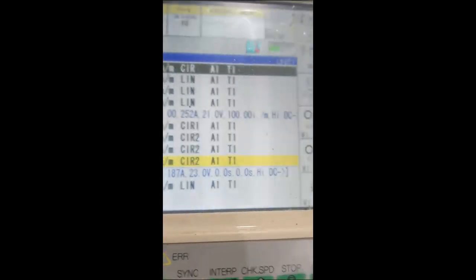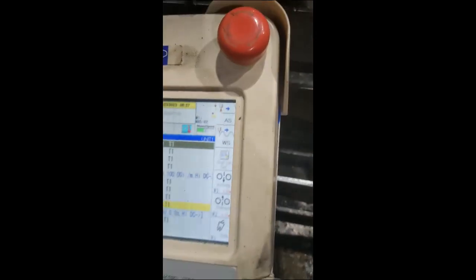We have four circular points: at the twelve o'clock position, the nine o'clock position, the six o'clock position, the three o'clock position, and then back around to roughly the twelve o'clock position. Sometimes it's a really good idea to overlap on a weld. That's my arc start setting right there, that's my arc end. We're going to check this out and make sure that everything's hunky dory.